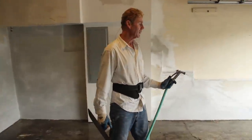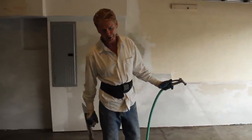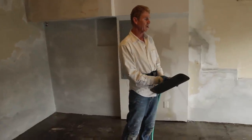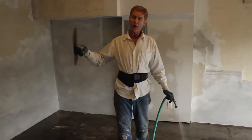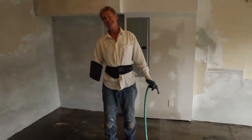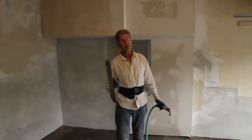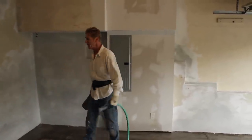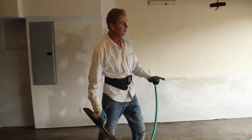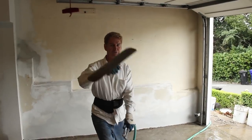What this video was really about was mold. We don't generally do a lot of mold videos and there's a good reason — there are a lot of rules and regulations. After we pressure washed, we had to cone off the area so all that mold went into buckets — we took about 20 buckets. There's a lot involved with mold that a 10-minute video can't explain. It's really about mold and ventilation, wherever it is. And by the way, you can get this plaster wet and when drier conditions return it'll dry right out. Sheetrock — do not touch it with water or it will resort back to its natural state: gypsum.